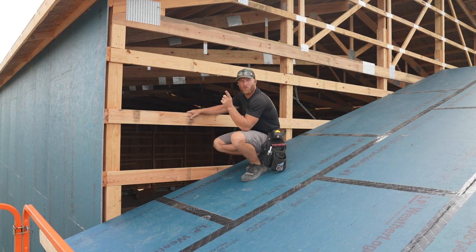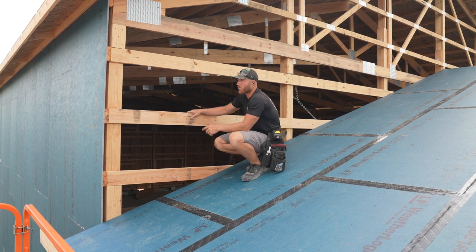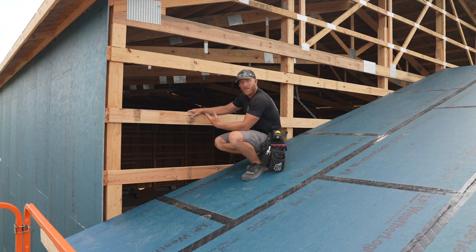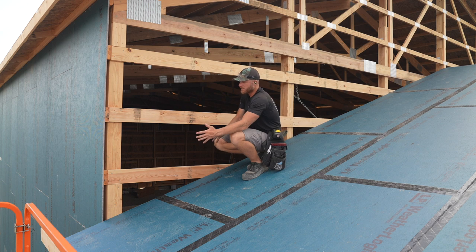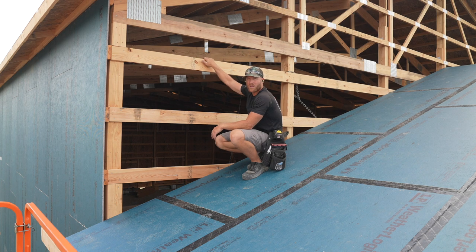I was going to do this wall early and get it out of the way, and here we are, last wall to do, and it's this one with the double angle cut. But I realized it's actually not going to be too bad, because when we cut a 4/12 pitch off of the bottom or the top, that piece will be able to be used on the other side, I do believe. Is it the other side, Greg? Think about this. No, literally it will go, so if I cut this bottom angle off, that piece will be able to go up here, so it's going to be very efficient. We've had very little waste of the Weatherlogic on this building, and I think we're going to get away without a whole lot of waste by the time we're all done.